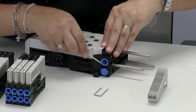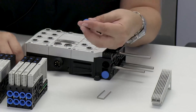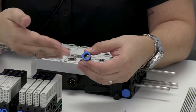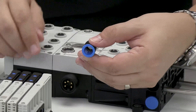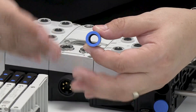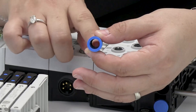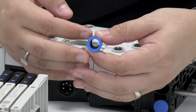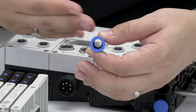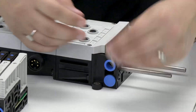One of the things I want to show on the fittings is this style of fitting — it's a newly designed fitting. This is the NPQX fitting, and we've designed these cartridge fittings to have maximized flow. It's probably not really easy to appreciate in the video, but you can see that the path is not blocked. Most typical fittings have a smaller orifice on the inside than the outside, and this does too, but it's not so restrictive in scale. So it really allows for high flows, meaning you can have really fast actuating valves and exhaust portions.